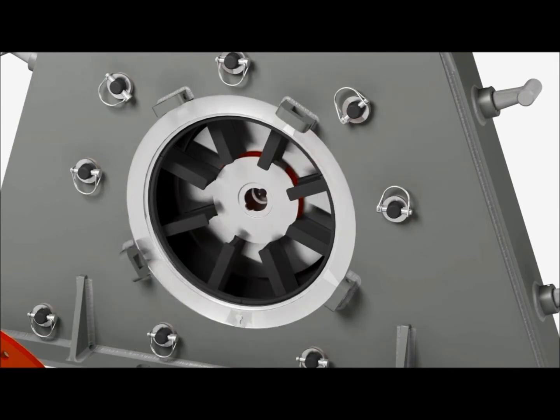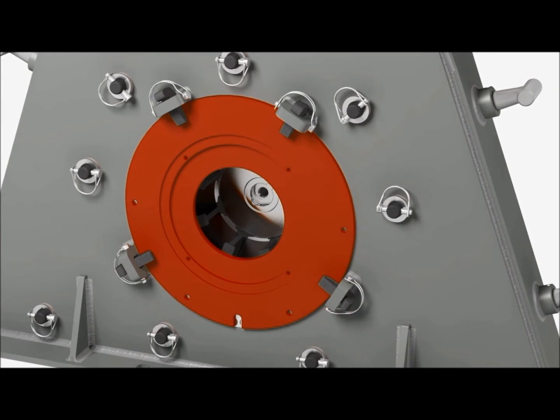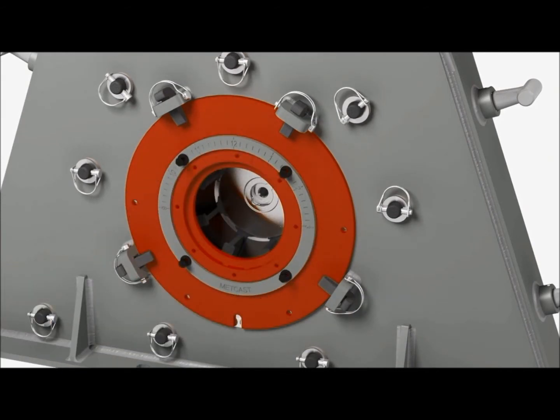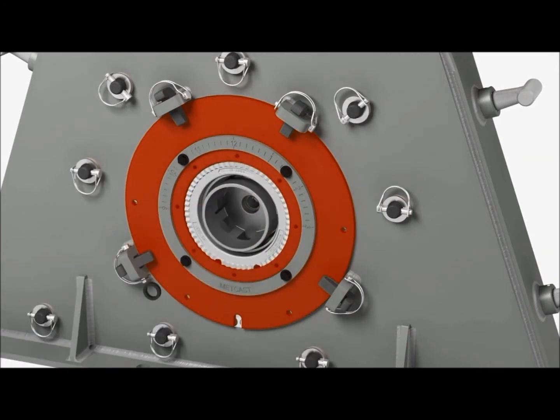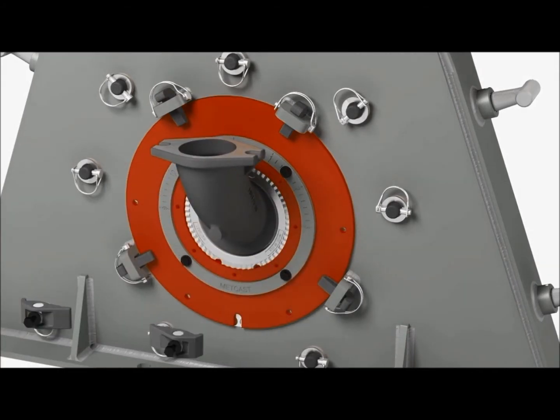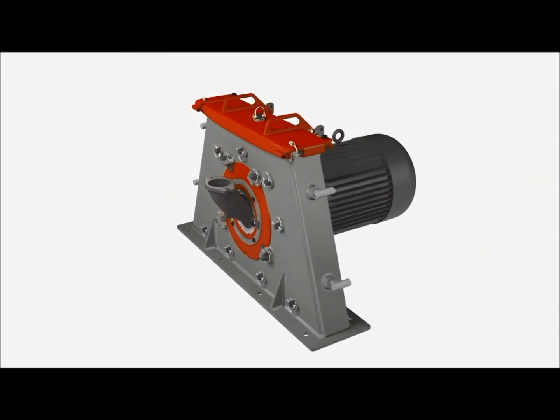A case-hardened machine cage adapter mates the machine surface of the M4 housing and utilizes innovative M-lock wedges with locking pins to clamp the adapter in place. Fewer threads, fewer problems. The control cage and precision machined impeller, followed by a cast alloy feed spout, finalize the M4 assembly.